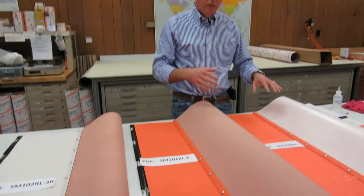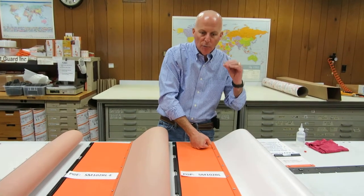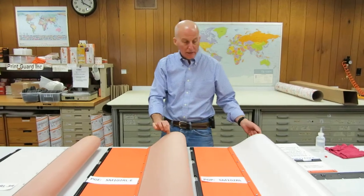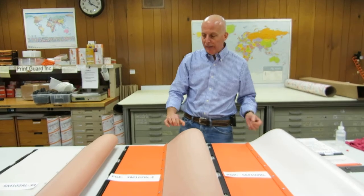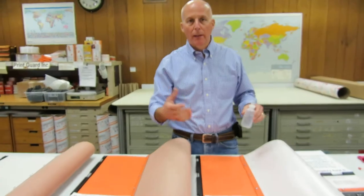The second feature is the backing, which has three important items. One is the resiliency of the material — how resilient and compressible it is and how well it comes back up. Two is the total jacket thickness, the 0.8 versus 1 millimeter. And finally, is the backing itself absorbent or repellent? You don't want something that's going to be absorbing liquids as you clean it.